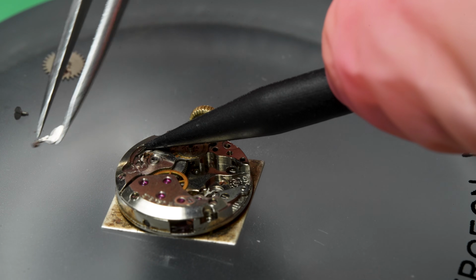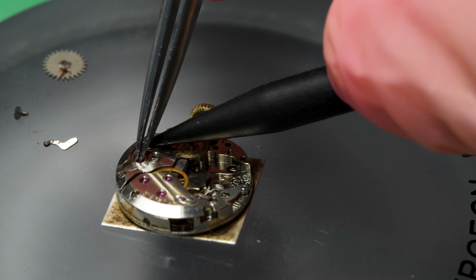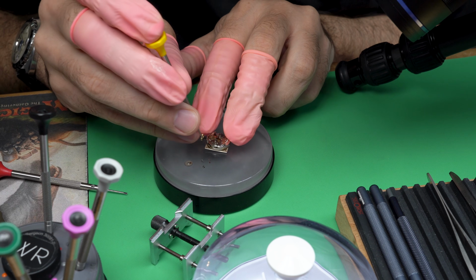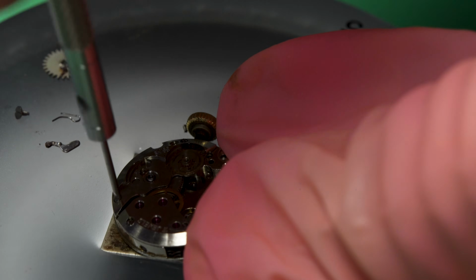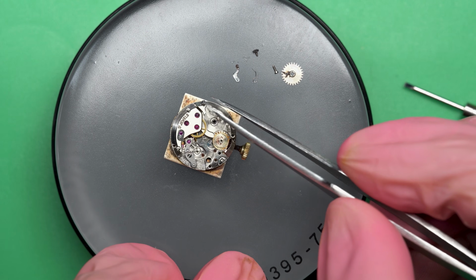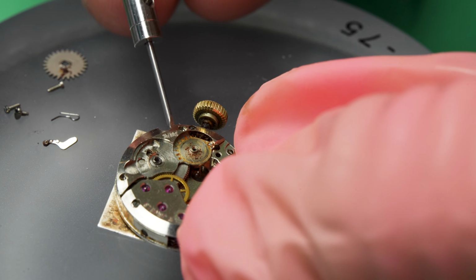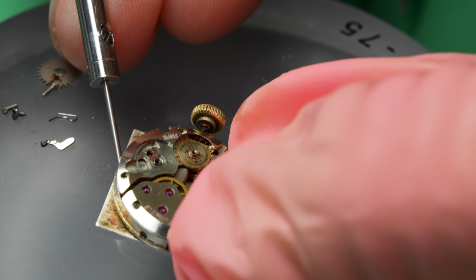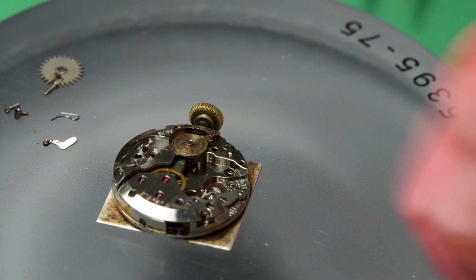And the rust, look, there's a couple of issues that it causes. Some of them are more cosmetic, where the rust doesn't actually eat away at the material. It just creates a surface level discoloration. That's quite easily fixable. When it comes to actually eating away at the metal itself, you have to do an assessment, because it will take away some of the material, and sometimes that can ruin the part, and sometimes it can still be functional after that, and you have to look at each part and figure it out from there.